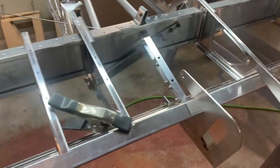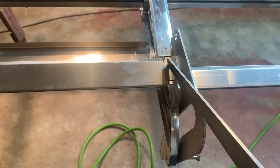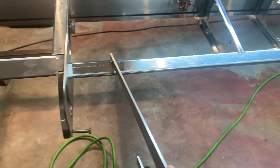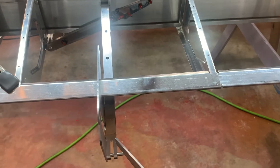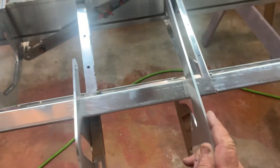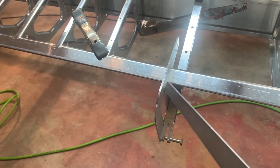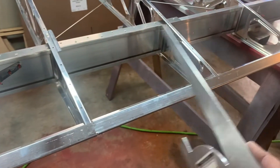Once you've got these done and locked in, we know everything's square. Then we're going to come back down to this one, take it off, and drill these holes that go into this piece here, and then that'll secure this machined rib. This inboard aileron will be set completely right. When you go back over this way, if you look as the manual says with the aileron — these fixtures will come off once you've got those set, and you're going to end up just using this piece here. You have to take these fixtures off — that's just an intermediate deal to get them all pushed up into place, because you already don't need them later.